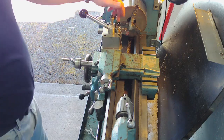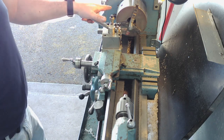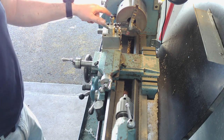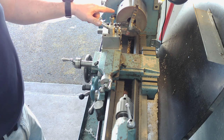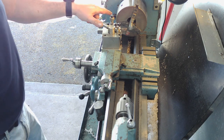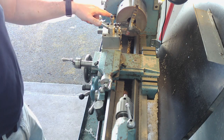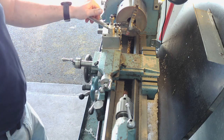Right guys, I've got a standard turning tool in there now, so we'll face that off and start turning the OD down for the 10mm thread. This will confirm whether the outside skin is hard or not when I turn the diameter. I don't know whether the parting tool had broken through the hard stuff and the hacksaw was cutting through the softer stuff in the middle. Could have been, but we'll find out in a minute.